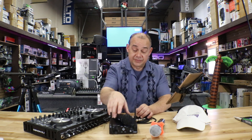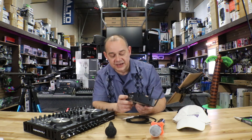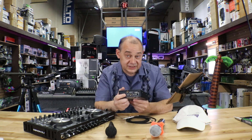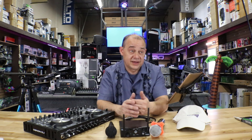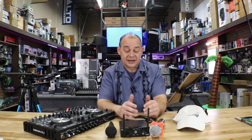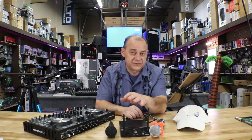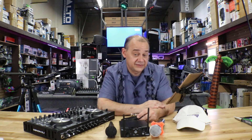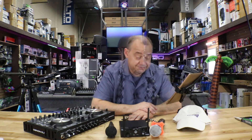Some equipment isn't set up for balanced use and can get confused, so always check your equipment. On the demo table with six feet or less of cable, unbalanced TR cables do the job just fine. This AKG wireless microphone system on the table says 'balanced' on it, so you can use unbalanced, but since it's built for balanced use, a balanced cable at both ends gives you built-in noise cancellation. That technology really kicks in on runs of 50 feet or greater.